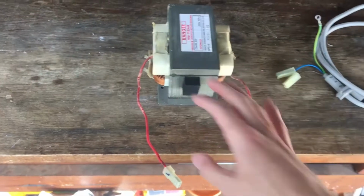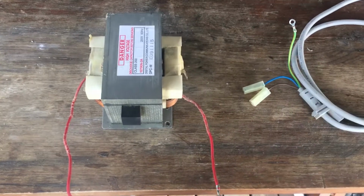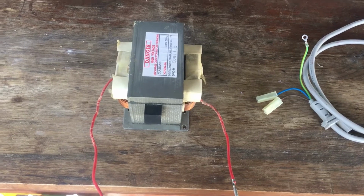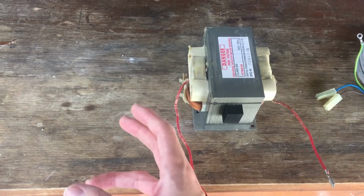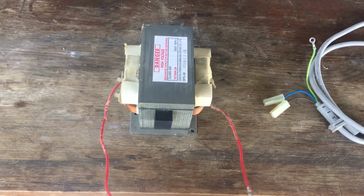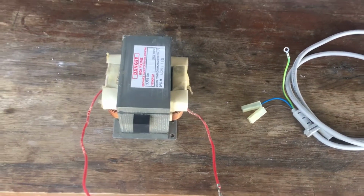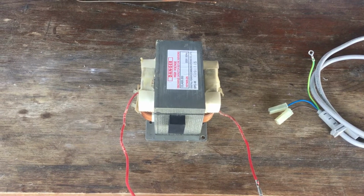We'll just plug it in, connect up the 2000 volts to the piece of wood of our choosing that we want to do our Lichtenberg figuring with, and then we'll make up maybe a little bit of a sodium bicarbonate solution just to lightly paint on the surface in order to make the surface conductive for our traces to traverse along. So I'll get that set up and hopefully get it to work.